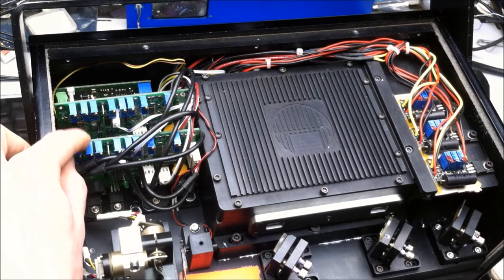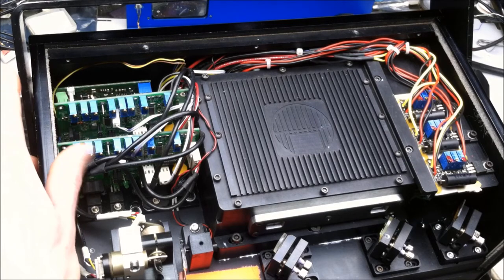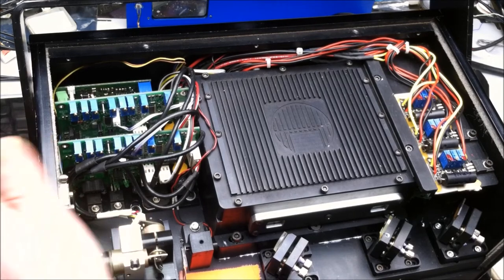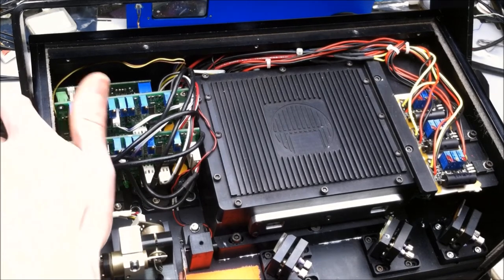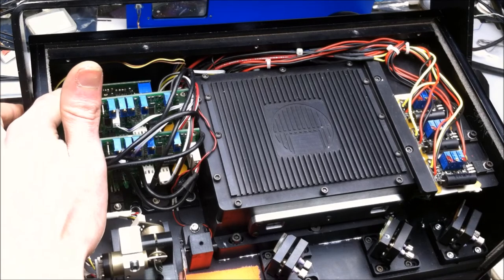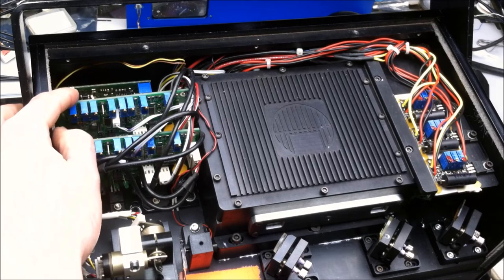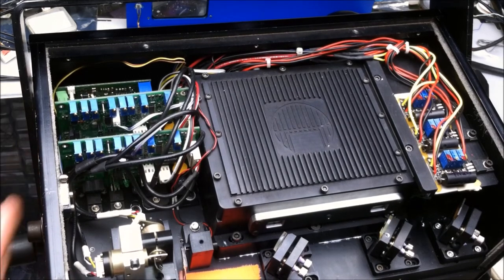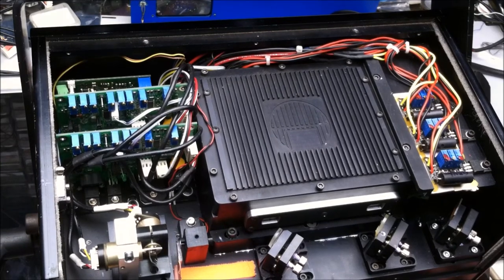When I saw the power supply, it didn't seem to be booting up. It looks like that's tied to the interlock. The galvos don't get any power at all when the laser key is off. So, one of these could be bad. I gotta check it out, but the resistance on those seemed to be pretty good. And I can check these out simply by swapping the galvos around, seeing if it's a bad galvo or not. But that was useful information to know on my part.